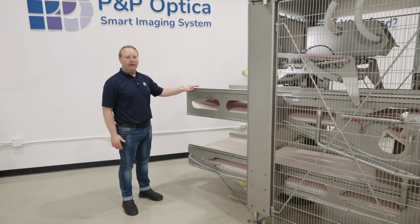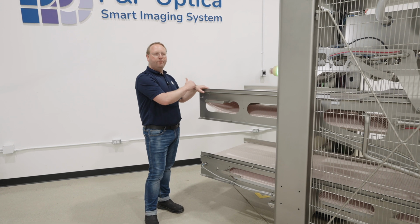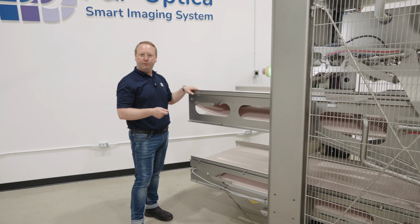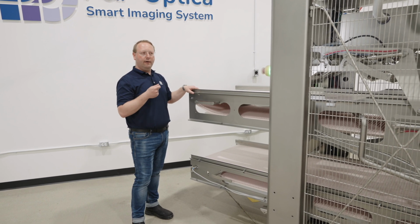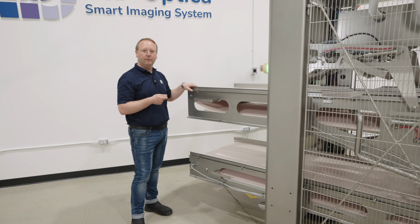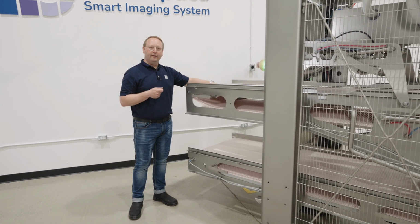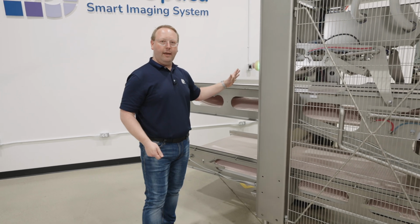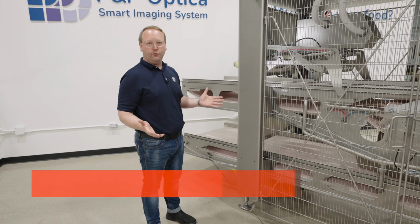the in-feed. The in-feed is where your product enters the machine. Bacon bits, fresh and frozen ground products, chicken, beef, pork are all being used today and inspected by PPO systems in North America. The product is going to enter on this side. It's going to flow through in a single layer, because if it's not in a single layer, that's where foreign materials are going to hide.